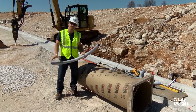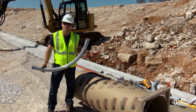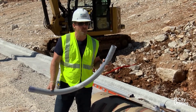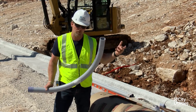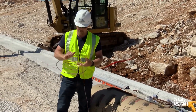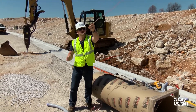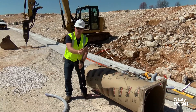We're at a location now where the contractor is fixing to actually install all the components used to complete and build this streetlight base before we pour the concrete. What I'm holding here is a plastic 24-inch radius PVC 90. Typically we have two — one coming in, one going out. On some plans or standards you may be working by, it may call for a smaller radius, may call for three, or may only call for one. Be sure and look at your plans and what the engineer has called out for this installation. Here is our copper at the bottom — this is just a simple roll that's placed in the bottom, a 10-foot roll. You usually have about eight feet, so you can plan on 18 to 24 feet of number four copper coming up through, with a minimum of two feet sticking out of the ground, coiled up and then placed back inside the pipe temporarily and taped off so it's out of the public's eye. This stuff has a tendency to disappear overnight.